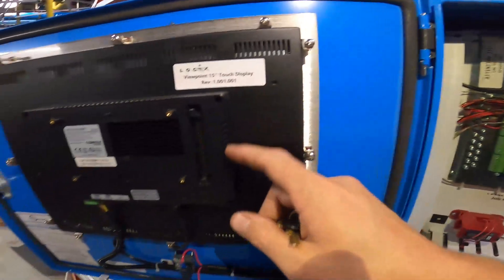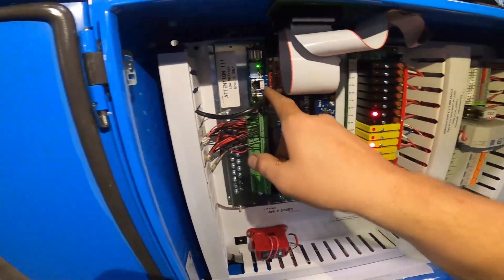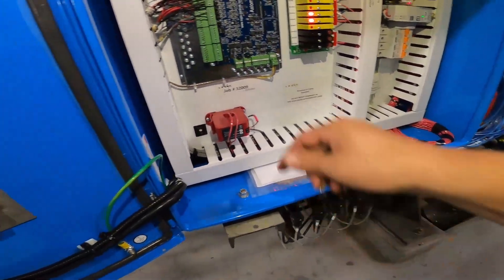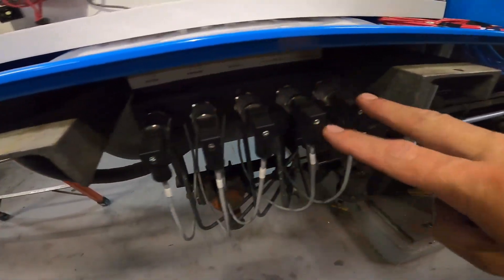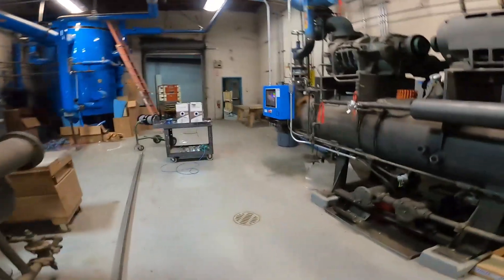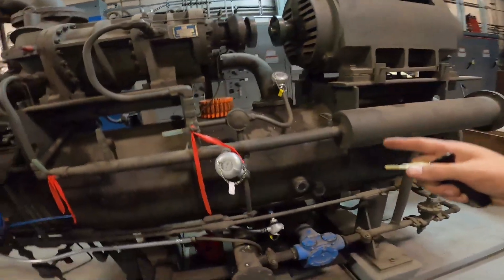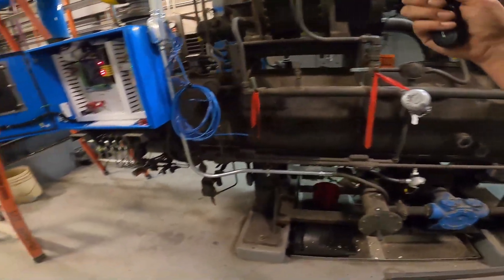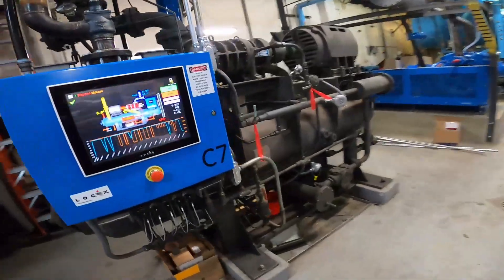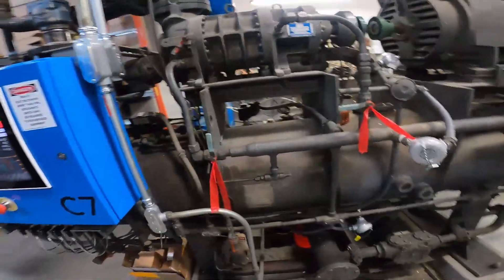Your ethernet to your panel here, and that's where the new ethernet's going to tie in right there. Here's all the spares, everything's done. This is the CT. Here's all the pressure transducers. This is the booster here. This is your high stage, off the medium temp. And this one is off the low stage but also has an economizer port on this one here.